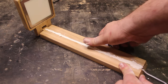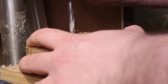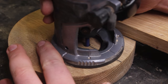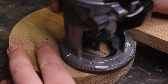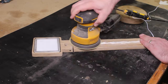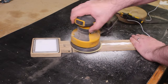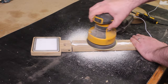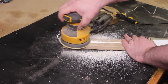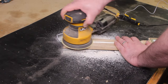The Milliput takes three or four hours to set up, so whilst that's happening I can get the base over to the drill press and get a hole drilled through for the cable. Then flipping the base over, I can use my router to create a channel so that the cable has a way of escaping from under the base — I don't really want to put feet on this so I need to create this channel. Once the Milliput's set up, I come back to it with the random orbit sander starting at 80 grit, just to remove any of the excess putty above the channel itself. It leaves a really nice clean line around the edges, and I went back through with all the other grits to make sure the finish matched all of the other parts.